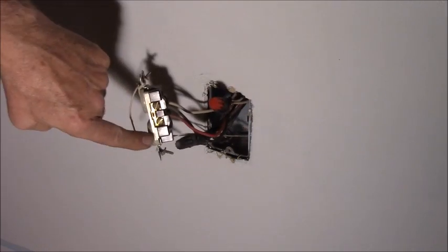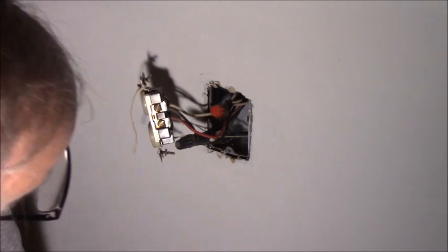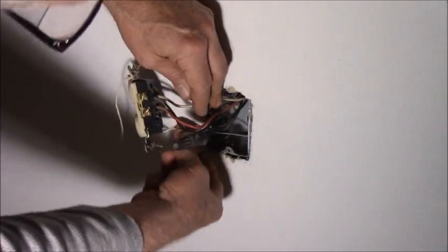The red wire feeds this outlet, and see the outlet has the bar still in there, so it's feeding out to the rest of this circuit. So they gotta be bugged together and ran to the top of this. I'm just concerned about the neutrals. This is where the master neutral is for that box over there, and I'm bringing another neutral in. I guess I can just tie them all together. But anyway, I got my string attached.